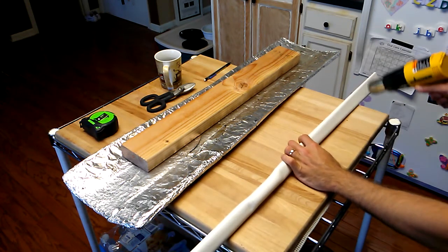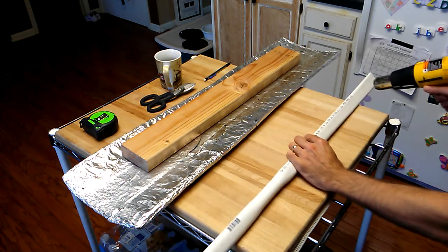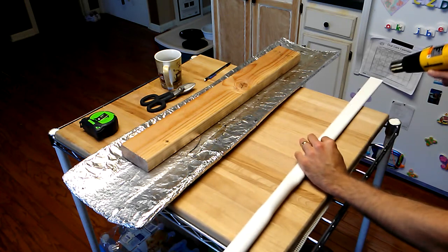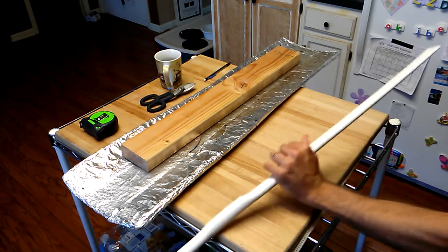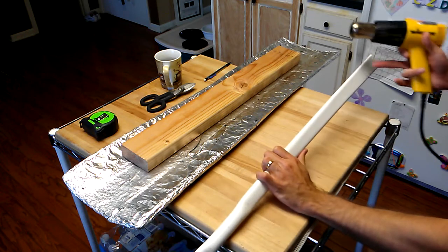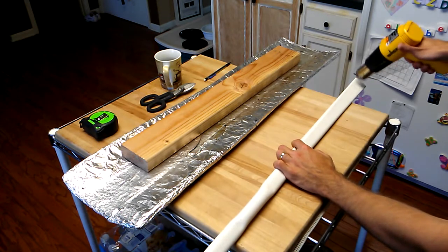When heating up the ends like this, when it's already been flattened, be very careful not to overheat the limbs. The flat parts are fine. There's lots of area for the heat to spread out on. But the thin parts on the side, the heat has only one way to go. Just take a look at that. It can only go down. You're trying to put a lot of heat into a very narrow area versus a very wide area, so the heat doesn't dissipate as quickly. It tends to overheat, and that's a very bad thing.